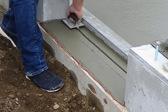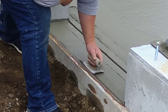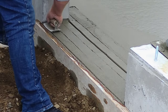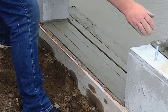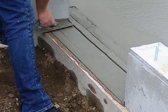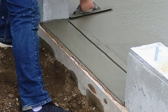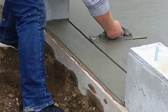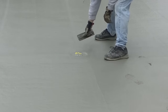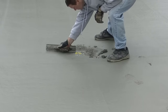The joints can be something decorative or just functional, which is what we're doing in this case. Wherever there's a walk-in or a place you drive in, we usually always edge the form right around that edge — it helps make it a little bit stronger. Once we use a jointer and edger, we always flatten it out with a mag float after, so we don't leave those marks in the concrete. You don't want to leave them as the concrete hardens because they'll just be harder to get out later.